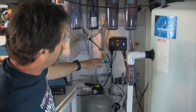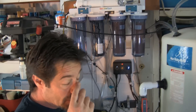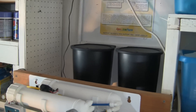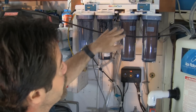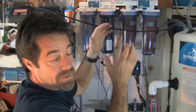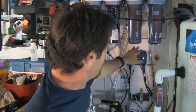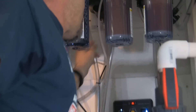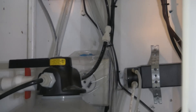We've also cleaned up all the lines and double-checked that both metering bins are level. I can't emphasize this enough — the metering bins need to be level. If they're not level, you end up with more water going in than going out, or vice versa. We double-checked the level, and while our screws were pretty level, there's a little bit of wiggle room when you mount the metering bins so you can adjust if needed. We then fastened all the lines down to the wall with some straps and pipe holders to clean things up.